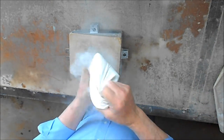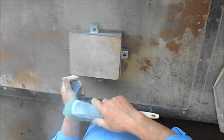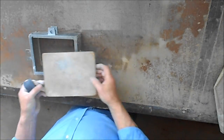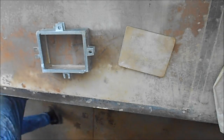It's clearly going to require an odd side. The first thing we do is give it a little dusting with parting agent. As is usual with me, the pattern is painted matte black and the parting agent just stays a little bit. First of all, let's ram that box solid.